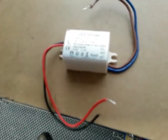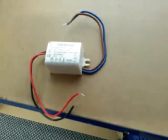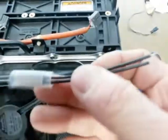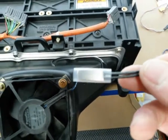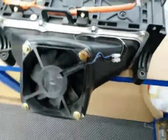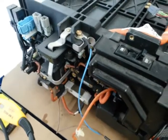These work quite happily from DC as well as AC. This is a 12 volt output one, it's 500 mA. The input of that is wired via a thermostat switch — this is a 30 degree centigrade switch, so it makes contact when the temperature goes above 30°C. That's powered from the normal grid charger tap points.